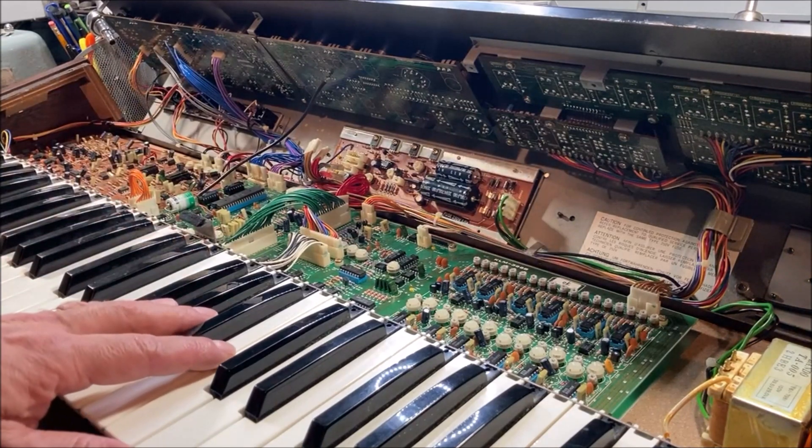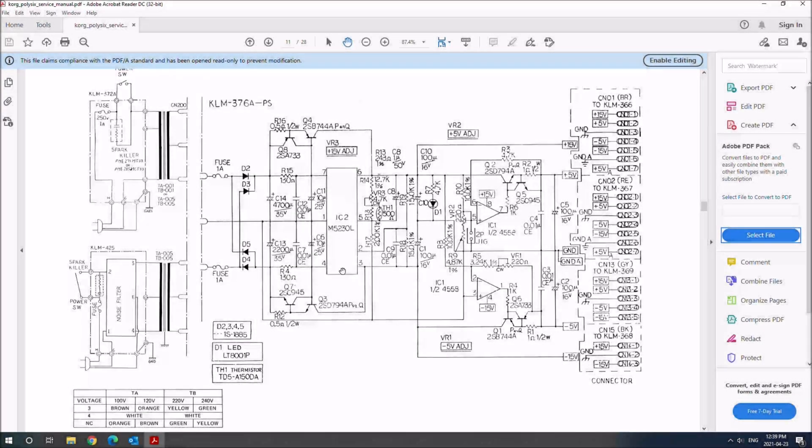Let's take a look at a schematic. So here is the power supply board and here's the plus 5 rail. You can see there's a variable resistor here to fine tune that voltage, an op amp — half of a 4558 — and this resistor connected to this power transistor, a current sensing resistor here and then another resistor, another transistor here. So this is a current limiting circuit. And what's happened is this is blown, this is blown, this is blown. So there's something that's shorting it and we'll have to figure out what that is.